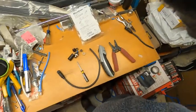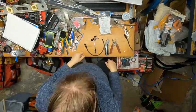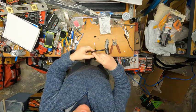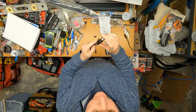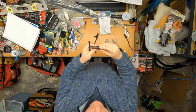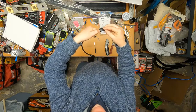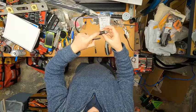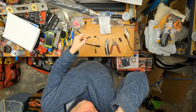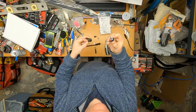I'm going to show you how this is done. We're going to take our wire, and we want to make sure we know how long to cut. They say to cut 20 millimeters off, but what I like to do is measure so the wire goes up to the top of this connector here. If I put my barrel over it, we don't want uninsulated wire sticking out the back. So we'll cut off about three quarters of an inch to an inch. If we make it too short, it ends up being really hard to move our wires and get them into the small holes on our connector.